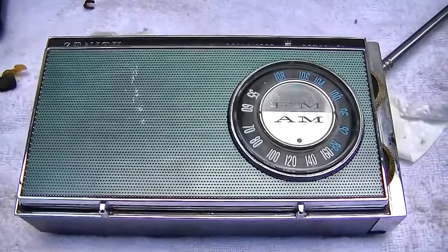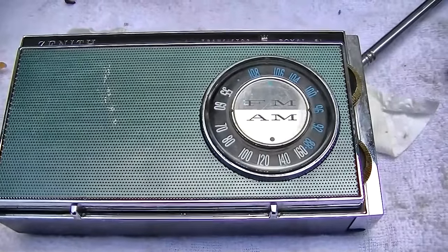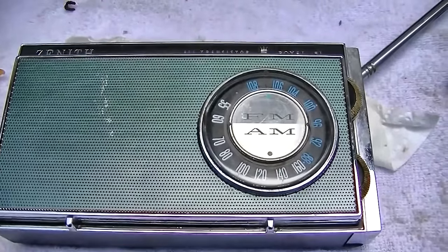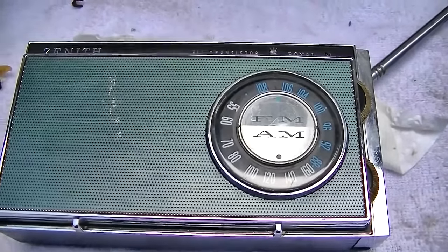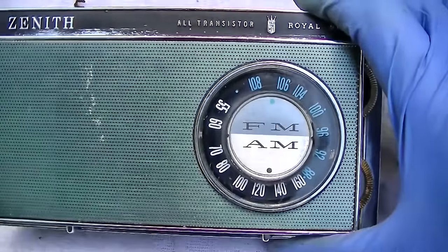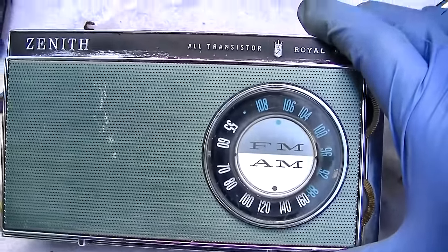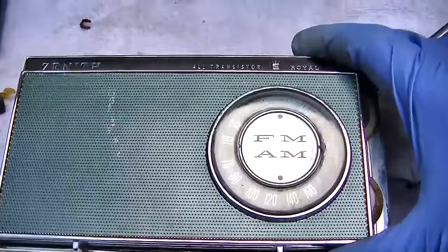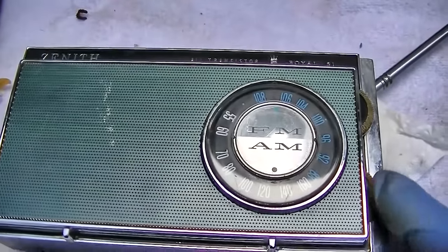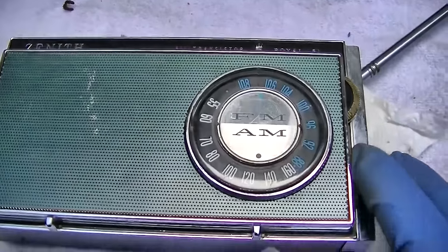I'd love for some AM radio buff to explain to me why, if that replacement antenna is causing the background noise on the AM. It's just like a lot of background noise, or is it a bad germanium transistor? It's just weird. Anyway, I think I got it working pretty good. All I got to say about these Royal 810s is, if you want to adopt one of these, you better be pretty good at fixing multiple problems in a radio, because these things are complicated and they are troublesome with the bad transistors and other problems.